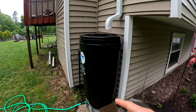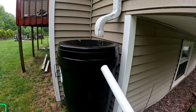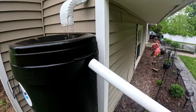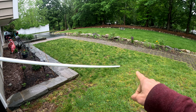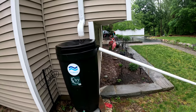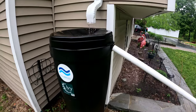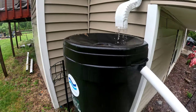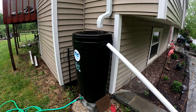So if you're going to use a rain barrel, which is great, you do have to cut a gutter — it's a bit unfortunate. But if you have a setup like this, make sure you always connect something to the overflow. In this case it's just a 10-foot PVC pipe so that if it does overflow, it goes out over there and down the driveway, rather than down into my rock wall and into my foundation. They are nice, but it's incredible how fast they fill up — and you want that overflow going away from your foundation, not towards it.